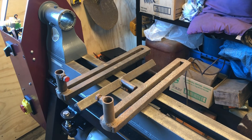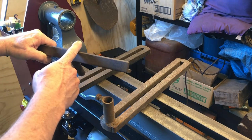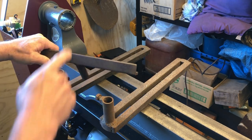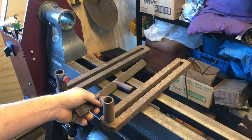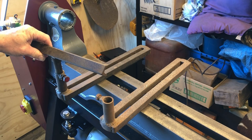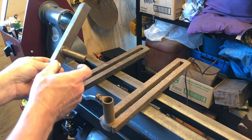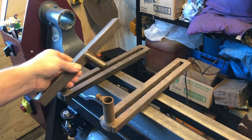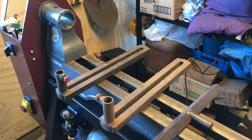A banjo is used to hold your tool rest, which is this piece here. Your tool sits on here and you move it around into the work to do your turning. This obviously fits into one of these holes and it can be twisted around and adjusted up and down. This is not a very long one here — normally they're a bit longer than that. We'll probably make a tool rest in a different video, but it's the banjo — this piece here — that I want to make.